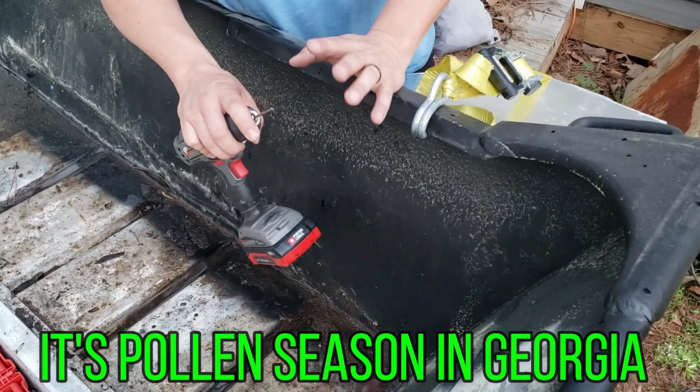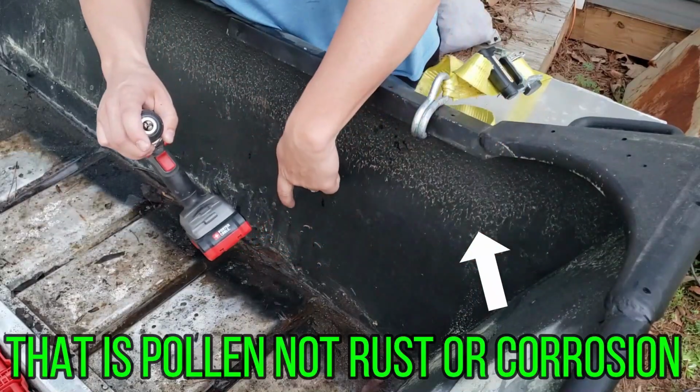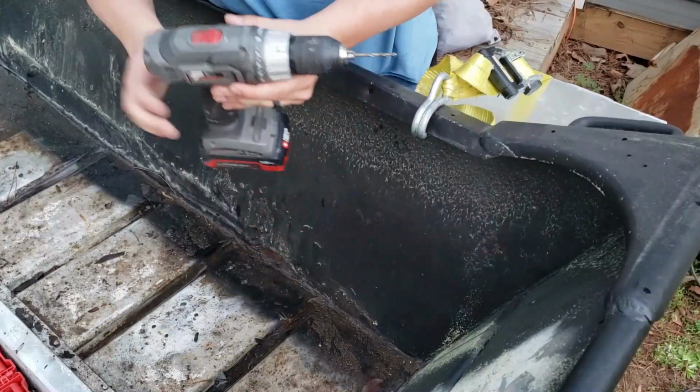I don't remember which size drill bit it is that gets up to the 1/4-inch. It's not an exact 1/4-inch hole that you need. So I'm just going to start at an 1/8 inch. I'm going to drill my top 2 corner holes so I know where those 2 rivets will go, and I'll work my way up until that rivet fits, and I'll let you know which size it is.